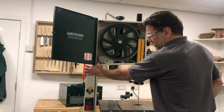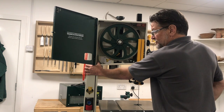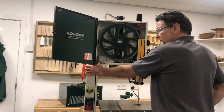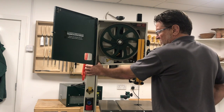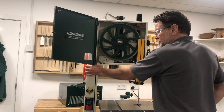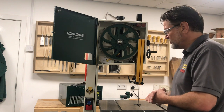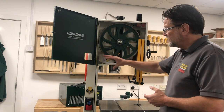What I look at doing is putting my hand around the frame and using my thumb. As my thumb starts to go white I've got about a quarter inch movement from center going away again. I don't want it too loose so I can press it easily up onto the frame, but I also don't want it too tight so there's hardly any movement at all. We're looking at 6 millimeter or quarter inch movement from center, and that feel will be consistent no matter what bandsaw you've got.